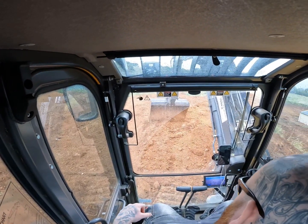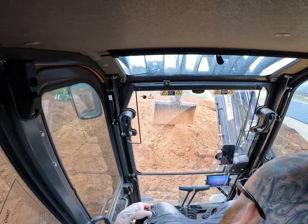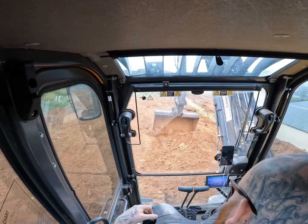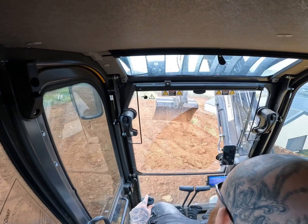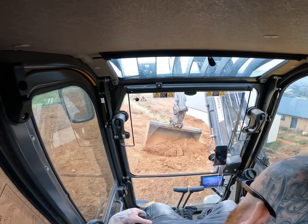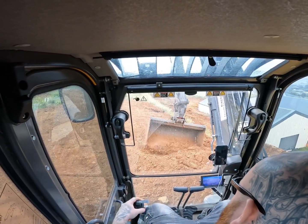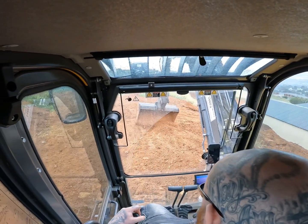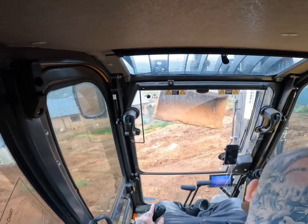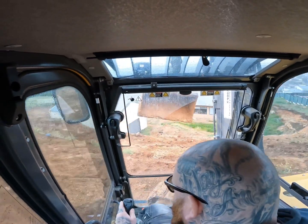So I reckon if we were to batter this up like this, put some rocks through it, a bit of geomesh, geofabric through, fine. Do a 2-metre wall at the base and then plan out. Just place rocks through the hill. Would be the best option, but just winging it. What I think is going to look the best.